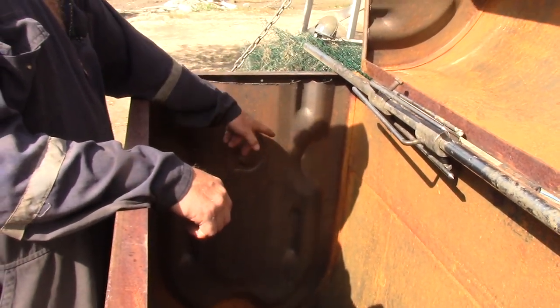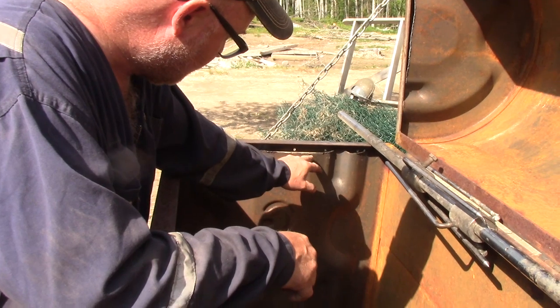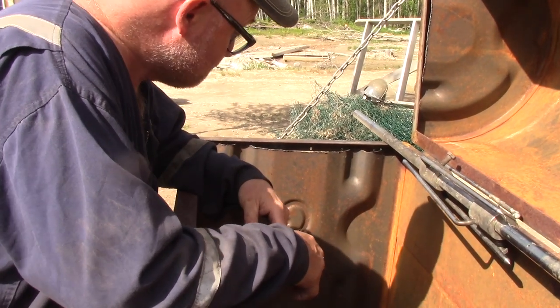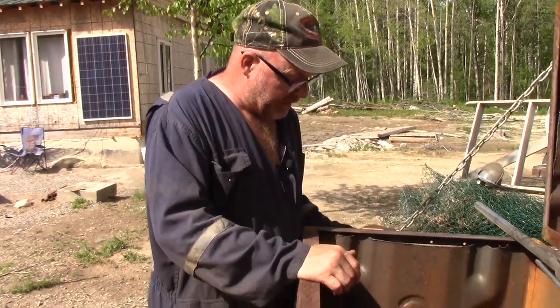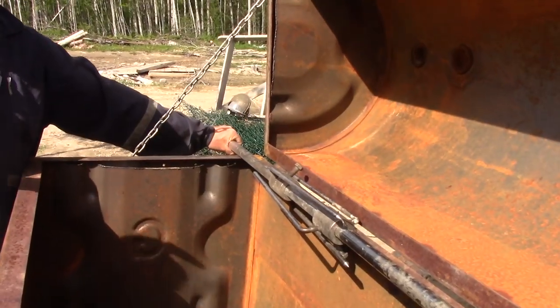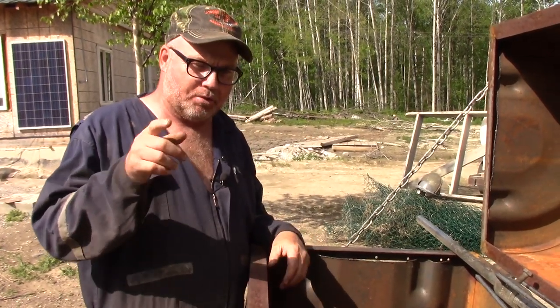Unless I just make a door here that opens, that it slides through. But I don't think I'm going to. I think I'm going to just cut a notch down through here. Somewhere here. And there'll be enough room to put in there. On this end, I'm not going to use a bearing. I'm going to put a plate on the outside with a piece of hardwood. Just with a long notch cut. Just so that this can sit down in there. And it can run in that hardwood. Now it will be stuck out far enough that it's not going to end up burning.